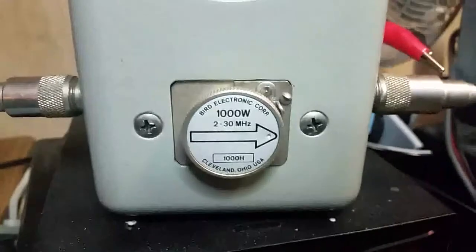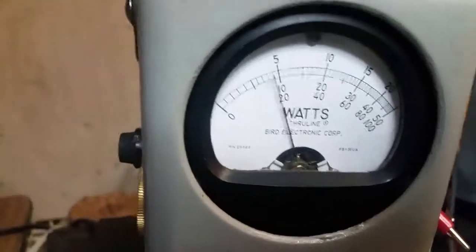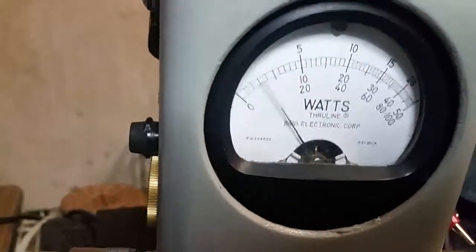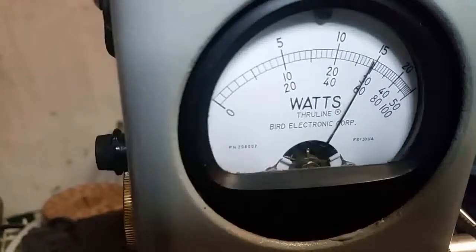Alrighty, we're on the unregulated supply. We're on the medium tap. Okay, we're floating at 18.3. She is going to drop to about 15 volts. Alright. Still on the bench radio, doing 4 watts RMS, about 18 to 20 peak. Here's what we're getting, just a little increase from going to the servo over to here. Oh yeah. Right there, about 200 RMS. Oh yeah. Shoot, boy, that thing's ranking at 600 watts. Good God.